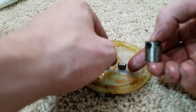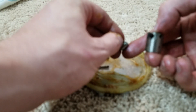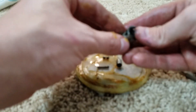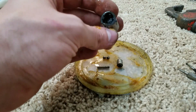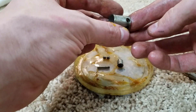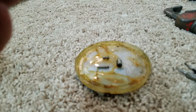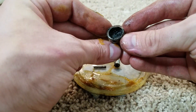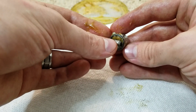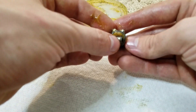This old grease is okay but it is kind of sticky, and especially if you haven't used yours in a long time, this stuff might get gummed up. I'm going to clean out all the old grease from the inside and use fresh ball bearing grease. Pretty much cleaned out all the old grease now.